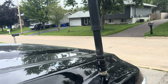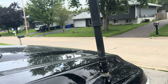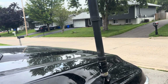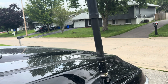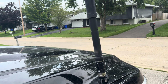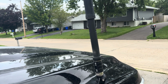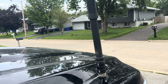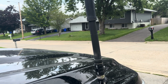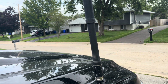This antenna interfaces with many of Yaesu's current and out of production radios by sending a signal through the coax cable to automatically raise and lower the antenna until a suitable SWR is achieved. As a bonus, this feature often further intrigues the keen-eyed passerby. If you have a good bond to your vehicle's ground, this baby will tune up 6 meters to 40 meters no problem, and it works seamlessly with the FT-891, especially on POTA activations or whenever you're feeling adventurous, but not so much so that you want to get out of your truck.